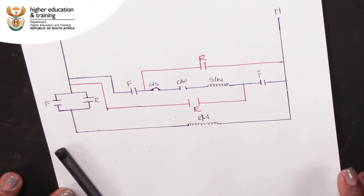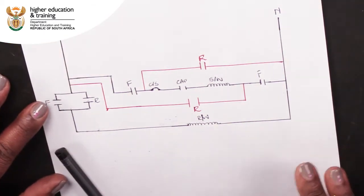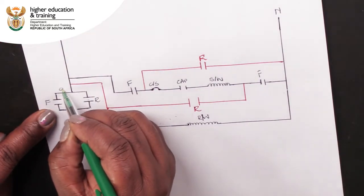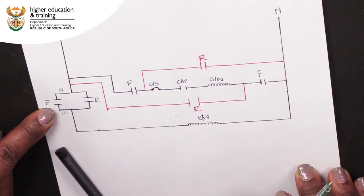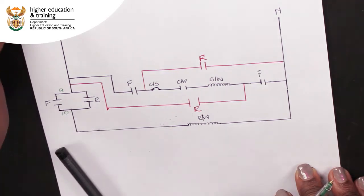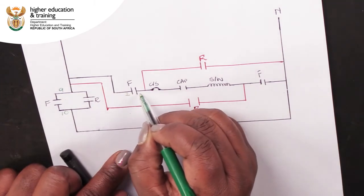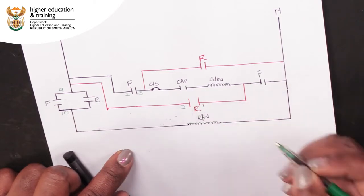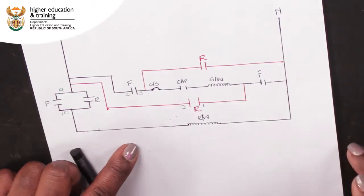This will reverse the direction of the motor. Now we need to map our rotary switch connections onto the schematic. The pair that was connected in the forward and reverse position was 9 and 10, so we will use this pair for the common set of switches, points 9 and 10. The pairs that were different we will use for the uncommon switches. Let's use 2 and 3 for the first forward switch and 1 and 2 for the first reverse switch. We will use 5 and 8 for the second forward switch.